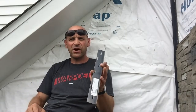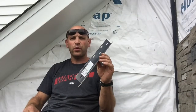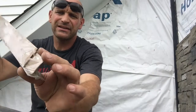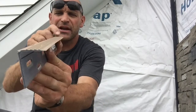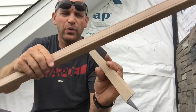The next thing we haven't talked about yet is your trim — what you want to put around windows and doors, or if you have a section of roof that comes down, you'll need a piece of trim there. Your trim pieces come as a unit that is shrink wrapped together, with a piece that gets nailed on and then a piece that clips on. Here is a section that gets nailed on, and you can see these ridges — that's where your clip-on piece will go into.